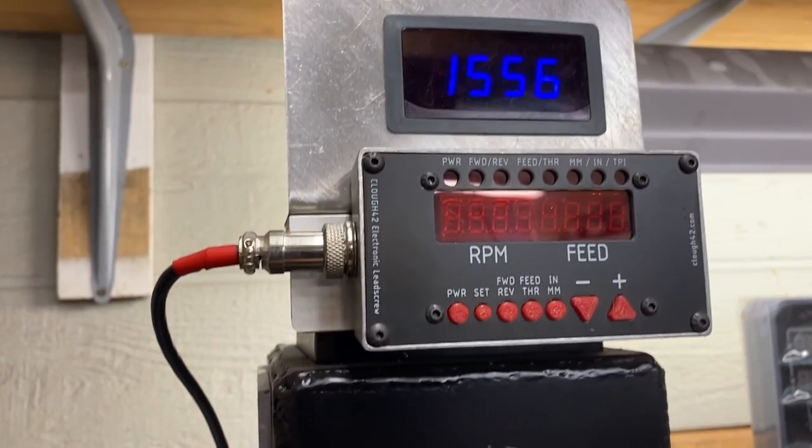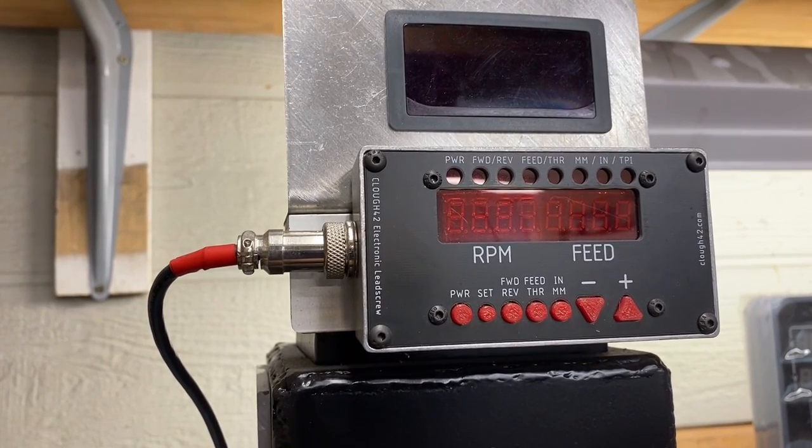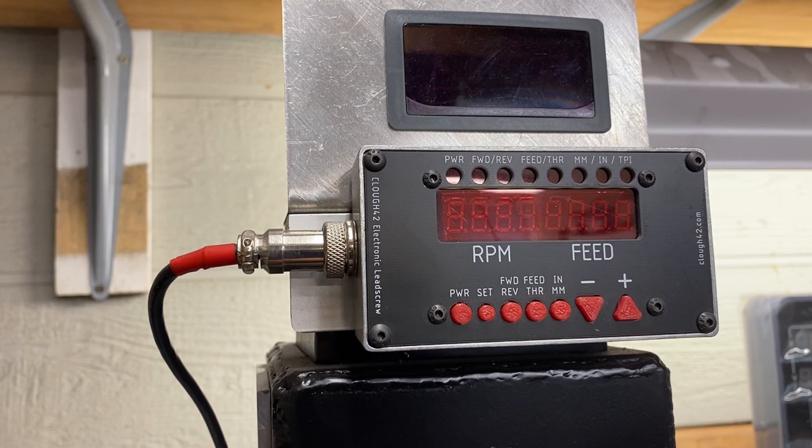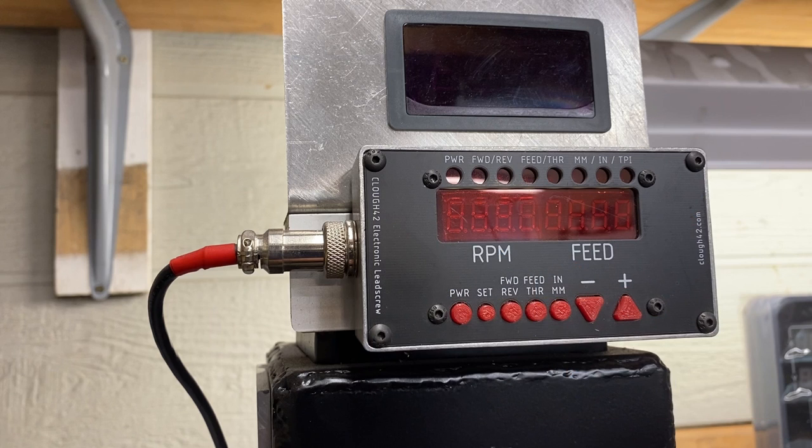With the RPM meter you can see we come in at about 1,550 RPMs at full speed, with a minimum of about 50 RPMs. The fine adjustment covers just under 250 RPMs total, so one small turn of the knob gets me somewhere between zero and 250. The coarse adjustment covers almost 1,200 RPMs, so that same small movement on coarse gets me several hundred RPMs. That's why I'm a huge proponent of using both coarse and fine — set up this way, I can dial in to within a couple of RPMs of exactly where I want.